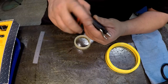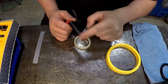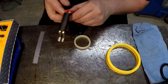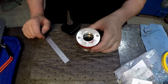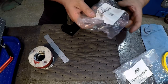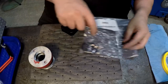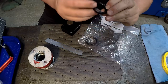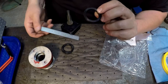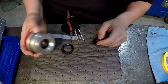This plastic here is designed to help keep from marring up and scratching the inner bore of the gland while you've got this down in there. The ones we have at work don't have this - it's just a metal rod in the middle. Alright, so let's go ahead and do it for the real thing now. This is one of the small rod glands with an inch and a quarter bore. We've got our seals - this is the one for inch and a half - it's our P seal, all bought from Hercules Hydraulics. There's our P seal, and as I said it's got the rubber O-ring expander in there.